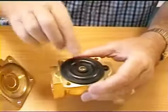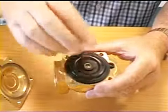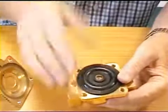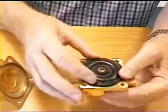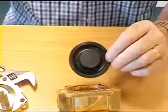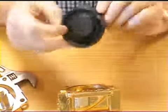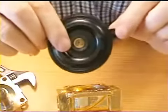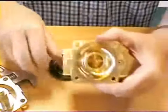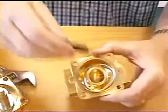And that means that it will allow the pressure to equalise between the top and the bottom of the seal, and it will just pop up. And that is why we call it pilot operated, because it's the pressure of the media that makes it work. But make sure that there are no foreign bodies on here, that this little tiny hole here is free, and that there's nothing here on the seat that's holding the seal off its seat properly,